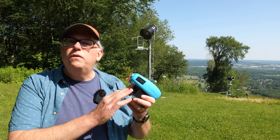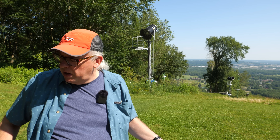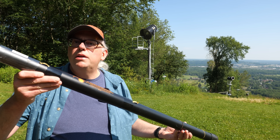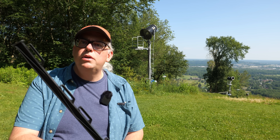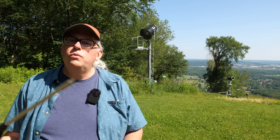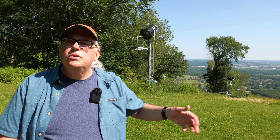Deploying the Reel Portable antenna is pretty straightforward — just unreel the line and put one end up into a tree or other support. Today we're going to use the trees behind me, but instead of throwing a line in the tree, I'm going to use my 31-foot fiberglass Jackite telescoping mast to support the end of the antenna. Then we'll bring it down to where I'm standing, and the transformer and reel unit will be supported with a four-foot fence post with a steel spike on the bottom, so the transformer will be a few feet off the ground. We're in a day-use area, so I try to be as light as possible.